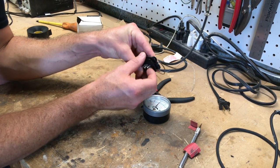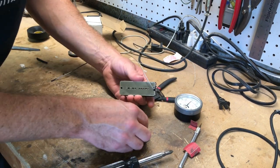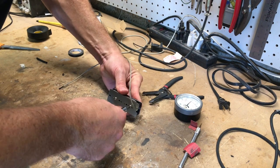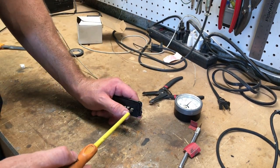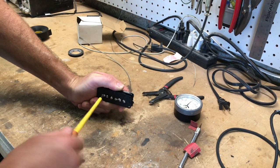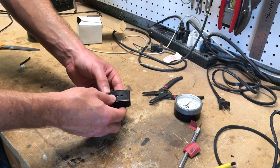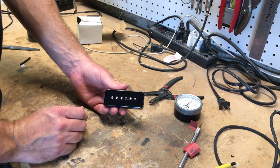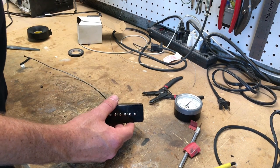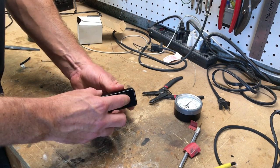It's not muddy at all — it's super clear. At this point we're going to attach our base plate. We've got our little screws here, there's already some wax on these screws — those are just going to go in like that. We'll finish turning in these pole pieces. The cover just goes on like that. Mounting screws go in here. This is not going to be wax potted because the early ones weren't wax potted, and we're not going to wax pot this one — we could if we wanted to, and we can always go back and do that later.